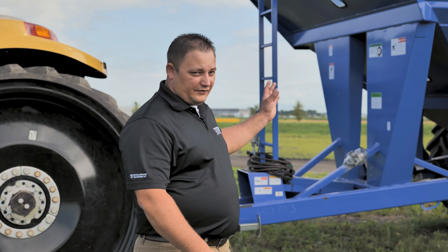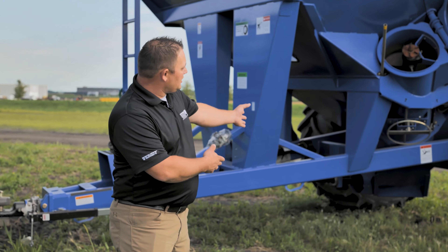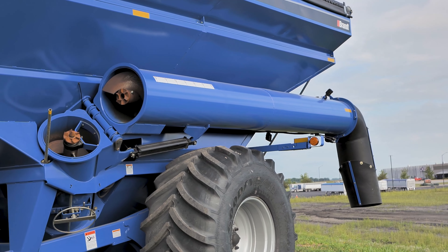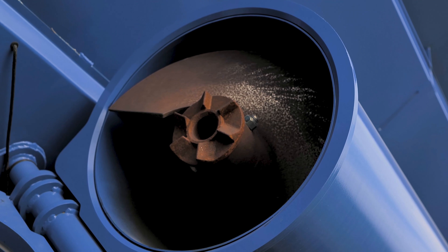The other big feature with this XR series that Brant does is they have a straight auger right out of the sump. It is a foot longer, foot taller, and coming out of the corner of the sump it gives you a little better visibility out the back corner of the cab of the tractor.